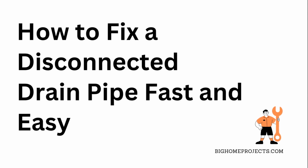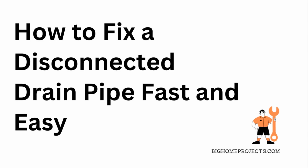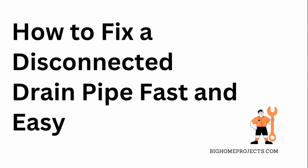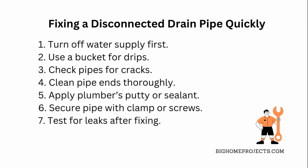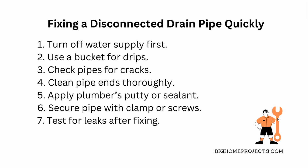If your drain pipe disconnected from the trap arm, you gotta fix it fast to avoid leaks and nasty smells messing up your space. So, here's the deal. First, turn off the water under the sink or wherever the pipe is. Grab a bucket to catch any water that drips out. Trust me, no one wants a mini flood.